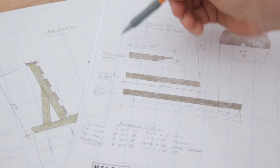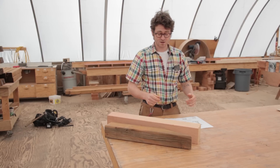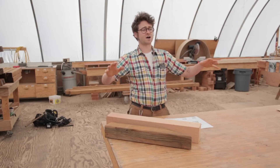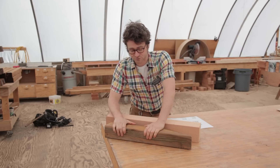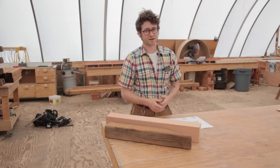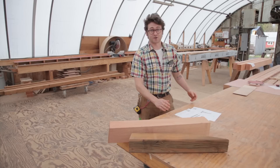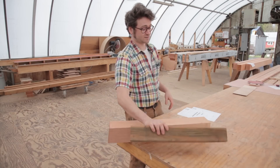We have our two supports at about 24 inches. The bridge is made of two different materials: we've got beautiful western red cedar here — really nice exterior grade stuff — which we're putting on our top rail and side rails, the parts you're going to be touching most. We're using pressure treated wood for more of the skeleton, including the stanchion and stair treads, because you'll be stomping on that with muddy feet. The cedar is the appealing stuff you want to touch; the pressure treated is more hidden in the background.